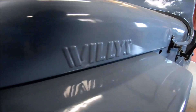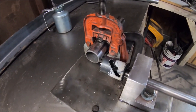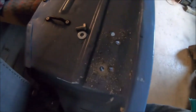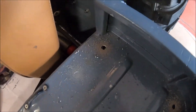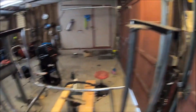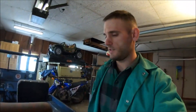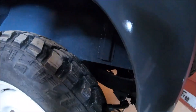Just got some updates for you on the Willys roll cage project. You saw the other day I got to notch the tubing using my handy dandy homemade notcher — so that's all done. I got the cage out right now, just drilling the holes. Since it was out I could mark them and get them all drilled. Now it's flipped up and I have it tack welded, so we're going to finish out the welds and then we can paint it and get ready to do the bracing. There are going to be plates underneath to attach it to the frame.